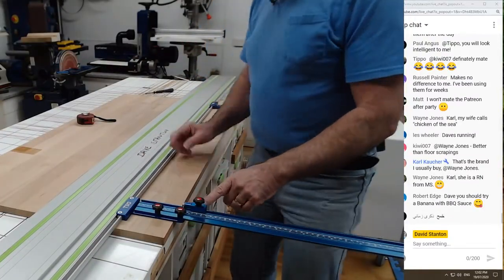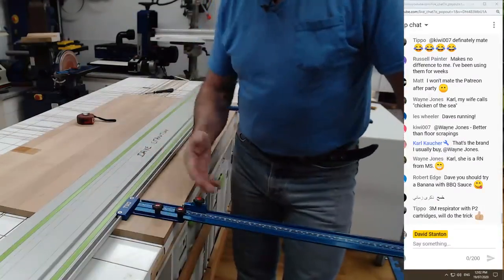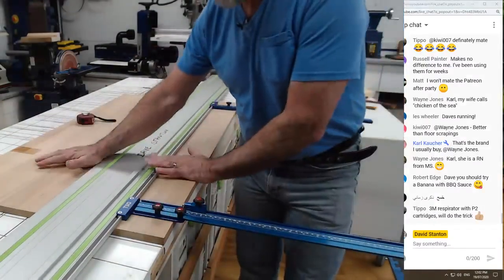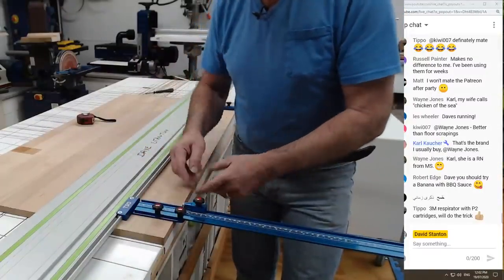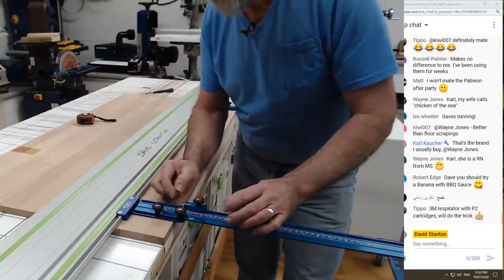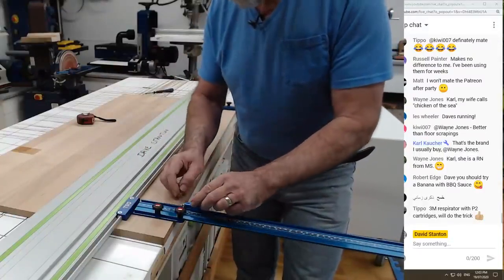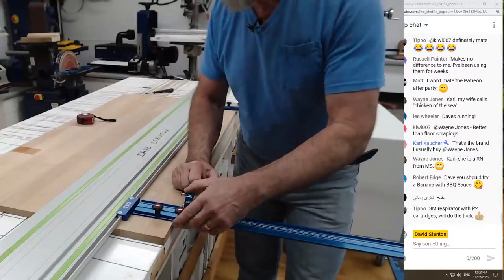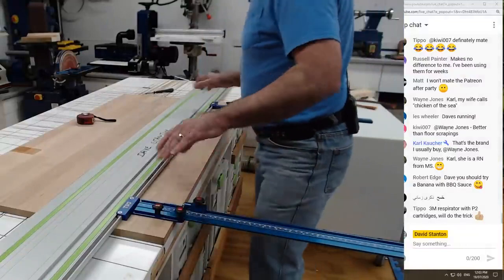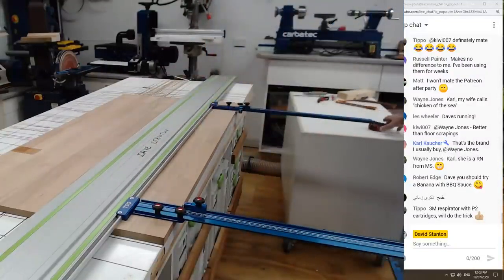And then all I do is I put the guides beside each other, like I'll have another one finished there. I set a square up on the board, line one up beside the square, the other one beside that, drop the bumper on the other one down to the same position. If I'm on 300 there, I'd go 300 on this one as well, and then nip up that Allen key. I'll do a video on how to do it properly, but it's just so quick and easy. There we go. That's 300 millimeters.